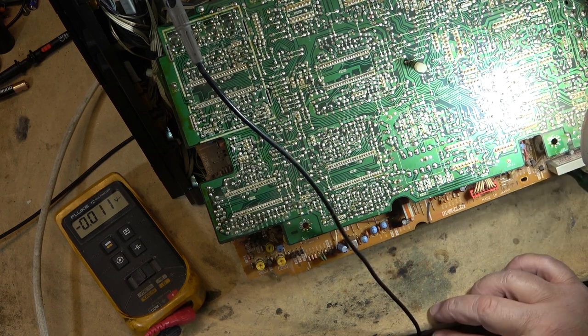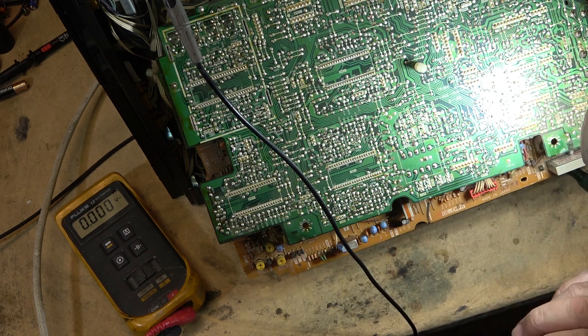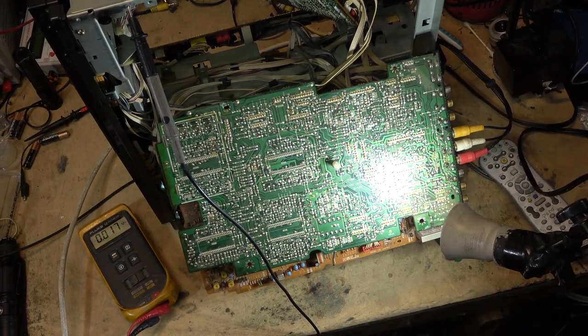This is the op amp. There's 2 of them for each output. And of course, the entire circuit's got negative supply voltage on it as well. But the negative 7 volt was missing. When I checked it, it's a JRC, what was it? IC number here again. JRC 4558, I think it was what I looked up. Or 4560, sorry, JRC 4560.